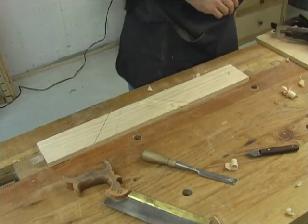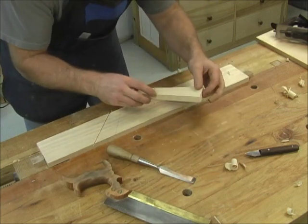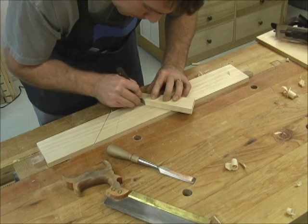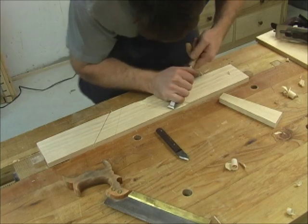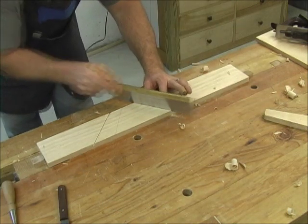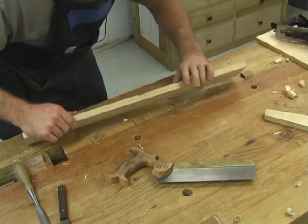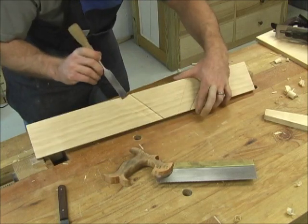no problem. We're going to take our wedge, place it against the freshly cut edge, bring that up to about where we want, and we're going to strike that line with a knife. And then we're going to proceed and do the exact same thing we just did on the other side, taking out a chip until we get enough depth to knock it out with the saw. And that's that. Now we're going to mark the back edge. Let me turn around and show you.